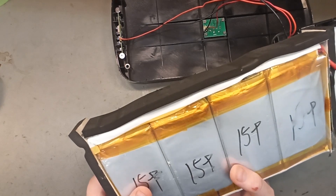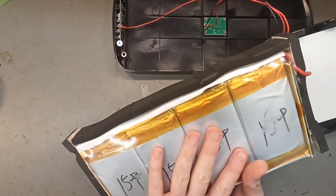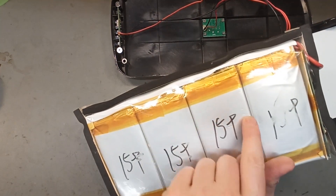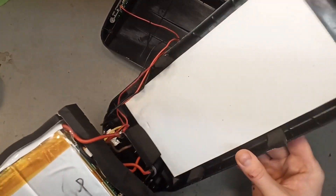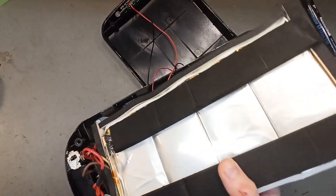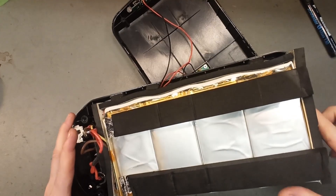But whoever built this battery — you should have those plastic bricks as you can see on the lipo bags, and there are tears over here. If gravel gets in, which it might have done, you can puncture those bags. So it's a really poor quality battery in a really poor quality case — just slightly bigger than the old frog.